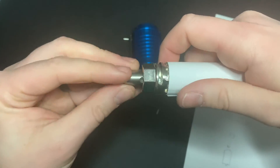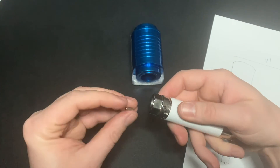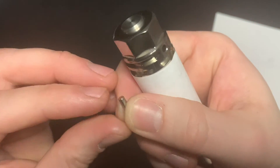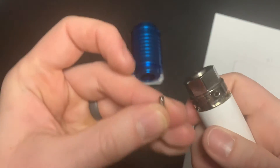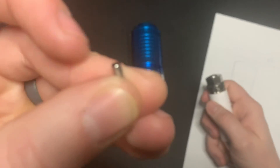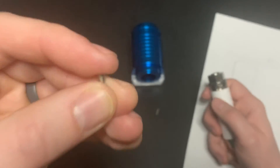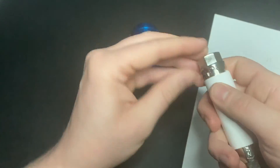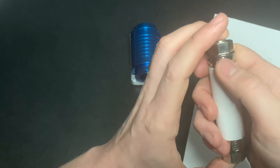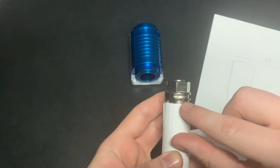The large part lines up, so I'll typically put in the draw pin first. I'll make sure I have the pins right here. This part is chamfered, and this chamfer is actually a little more prominent. This chamfered end goes in first — you insert that in. You may need to twist your draw bar around a little bit to get it to line up. So now it's pressed in. I'll put my index finger here and rotate it around to where I see the maze hole.